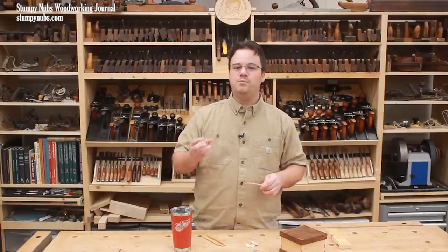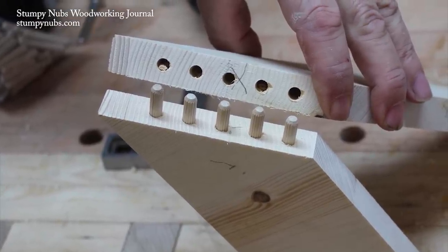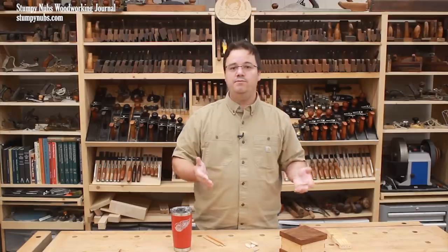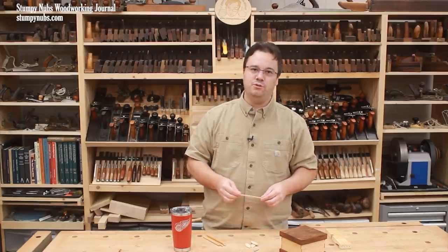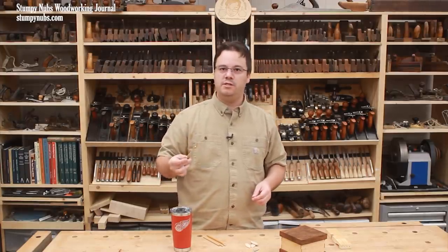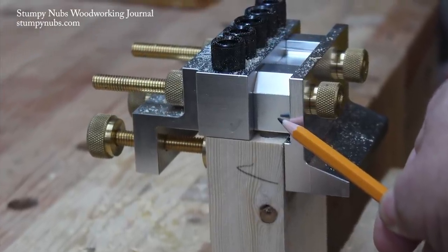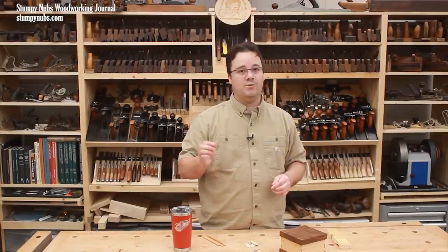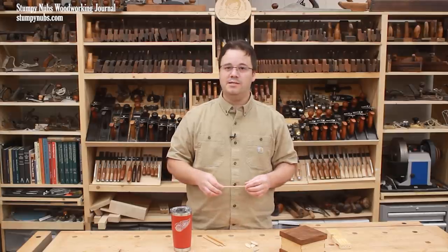The problem with dowel joinery, though, is it must be very precise. It's one thing to fit a single tenon or dowel into a single mortise; it's another to fit several dowels into several mortises at the same time — everything must align perfectly. And because you're drilling holes in both mating work pieces, alignment errors can compound very quickly. Even if you do manage to push and smash a poor-fitting dowel joint together, those inaccuracies can create gaps that compromise your glue bond. So to create strong structural dowel joints, you need a very accurate jig. I use the Dowelmax, which is not a sponsor — it's just a great jig from a great small business, and I'll link to it below this video. If you have a good jig and you know how to use it properly, dowels are no different than dominoes when it comes to strength. Where dowels do fall short, in my opinion, is inconvenience — it takes time to bore all those perfectly aligned holes, and the glue-up process can be a little messy.